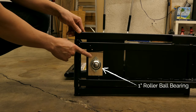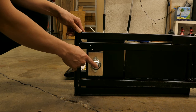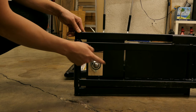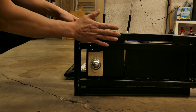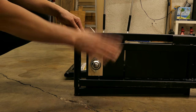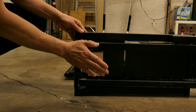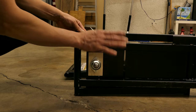Let's go ahead and show you the rear one. Here is the rear one that I purchased — this is the larger ball bearing setup. I believe they considered this one an inch and the other one is like a half inch or five-eighths inch. But I'll give you guys the link on my channel. What I did was I put it on a block — I 3M'd it to this plate here — and this block gives the ball bearing enough height that when you lay the QuickJack completely flat on the ground, these bars here will stay off the ground and the QuickJack can simply just roll around. When this arm starts to move up, the ball bearing will essentially lose its contact with the ground so that you have this section in contact with the ground for stability.